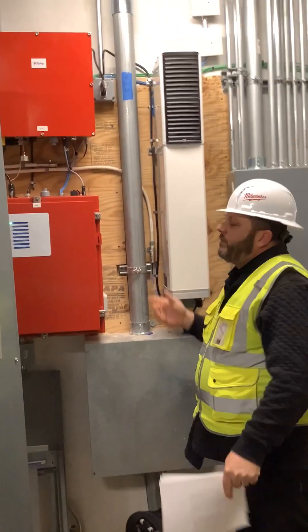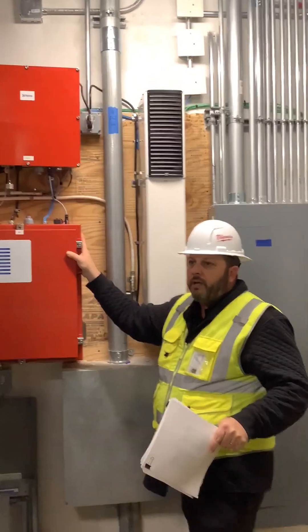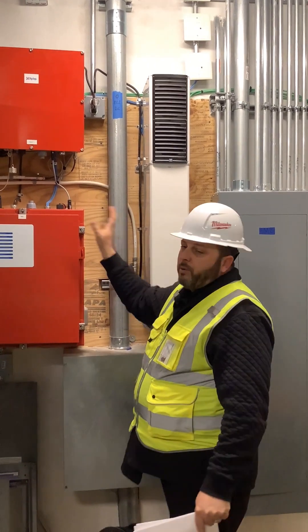We do a pre-test. If the signal is good, then these aren't required. But if the signal fails in any part of a building, the fire marshal will not give you an occupancy permit without it.